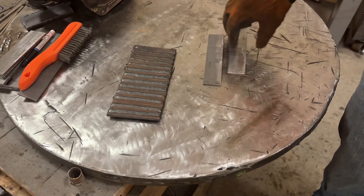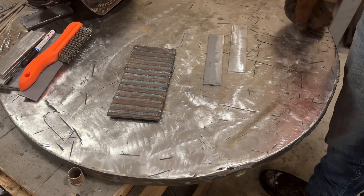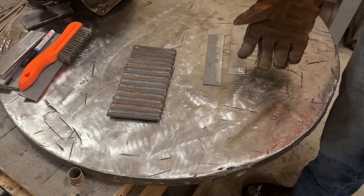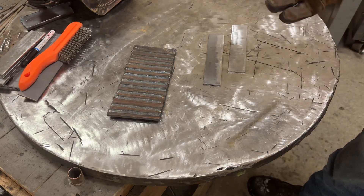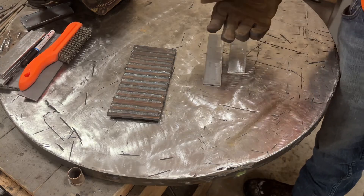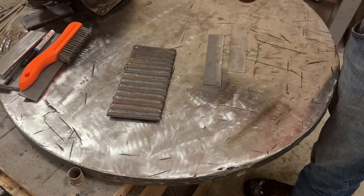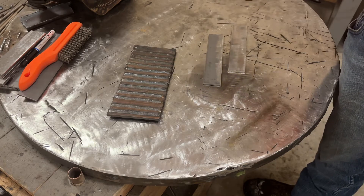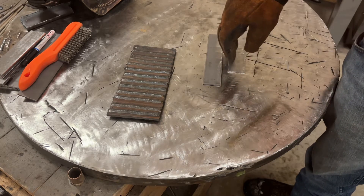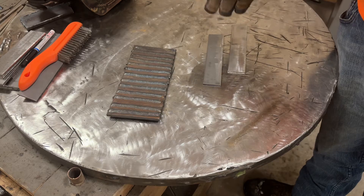What's up YouTubers. Since it's cold, snowy, and I can't snowblow yet because it's still downpouring snow out there — it is Wisconsin in January — I thought I'd shoot a quick video on a topic that affects all of us. No, it's not world hunger or taxes — it's undercut. When you weld, it can happen in any process where your weld basically fails to deposit enough metal, and your plates end up with a recessed weld or chewed away on the sides. It's a weld defect we don't want.